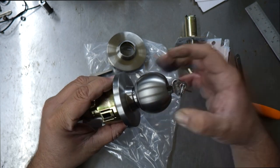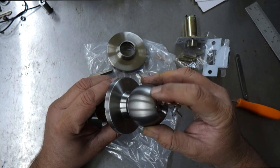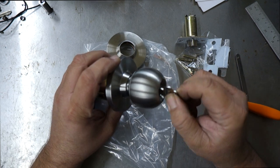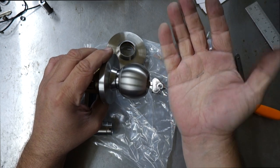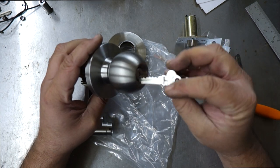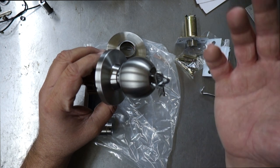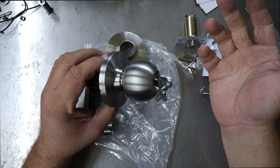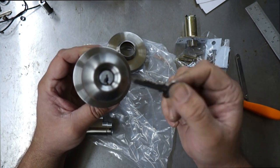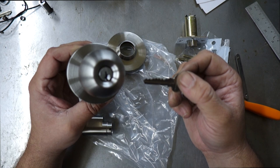The reason it was so hard to put back on is that in this particular batch the shaft was slightly bigger than the knob, so I had to give it a tap and it marked slightly. Now the key orientation is correct — grooves facing up. The reason you want grooves up is that the internal pins and springs work with gravity; if the key were upside down, gravity would pull the pins the wrong way, making the lock easier to pick or damage. With correct orientation, gravity keeps the pins seated on the key grooves.